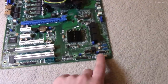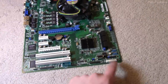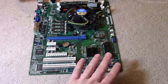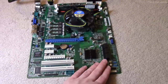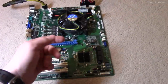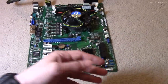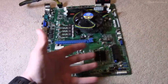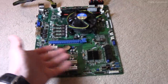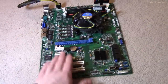In this case, this board actually has that — it's this blue jumper here, just jumped out, so there's no switch connected but you could connect one if you wanted to. On that other board, the circuit was basically always asserted. You'd power it up, it would say someone opened the box, you'd clear it, it would reboot and tell you again — even though the jumper was there. So you could never boot into an operating system; the board was effectively useless. I tracked it down to a bad transistor, and since I didn't need the circuit I just ripped it off, and the board is still functional to this day.